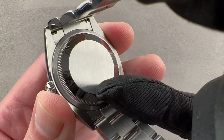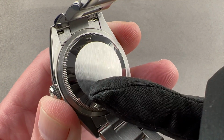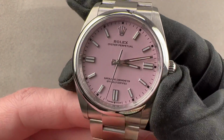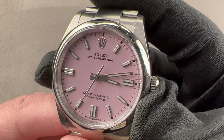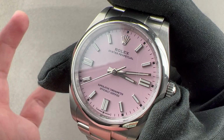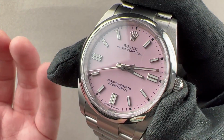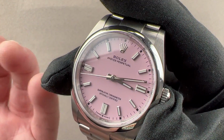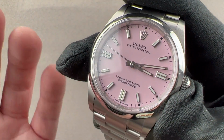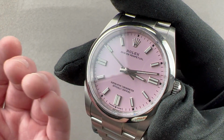Inside the case, Rolex manufacture caliber 3230, bidirectional automatic winding, 70-hour power reserve. It uses the Chronergy escapement, which, though more like a traditional Swiss lever, truly is Rolex's answer to the Omega coaxial, both in terms of tech spec and performance. The watch beats away at 8 beats per second, pivots on 31 jewels.